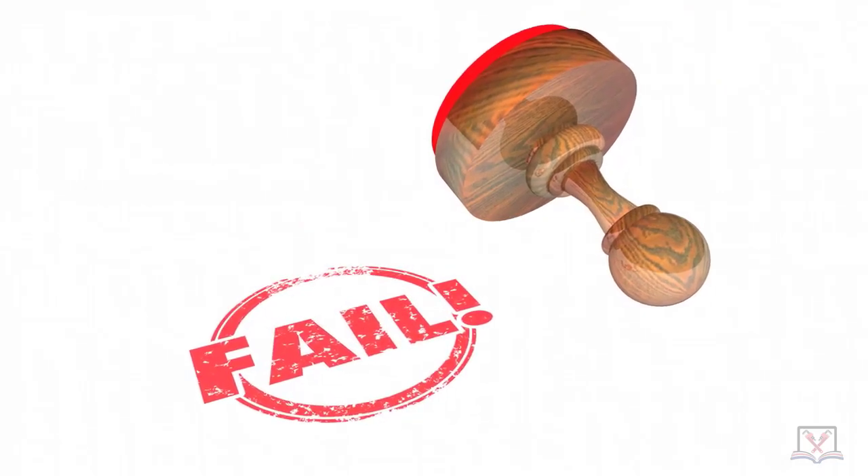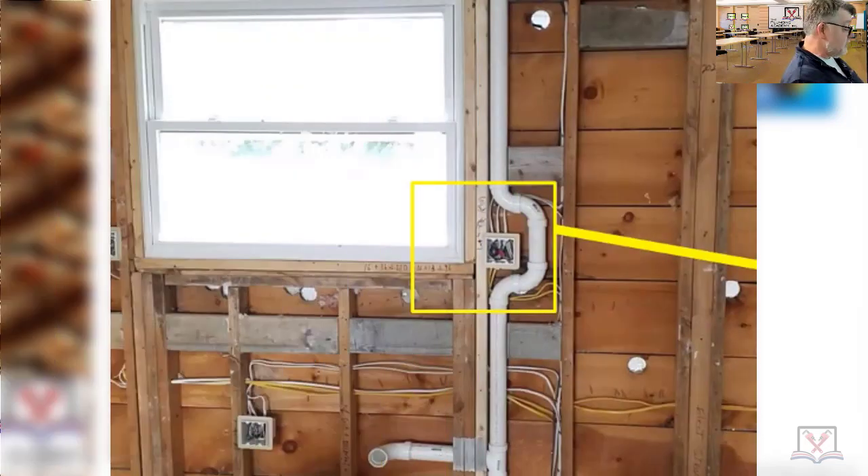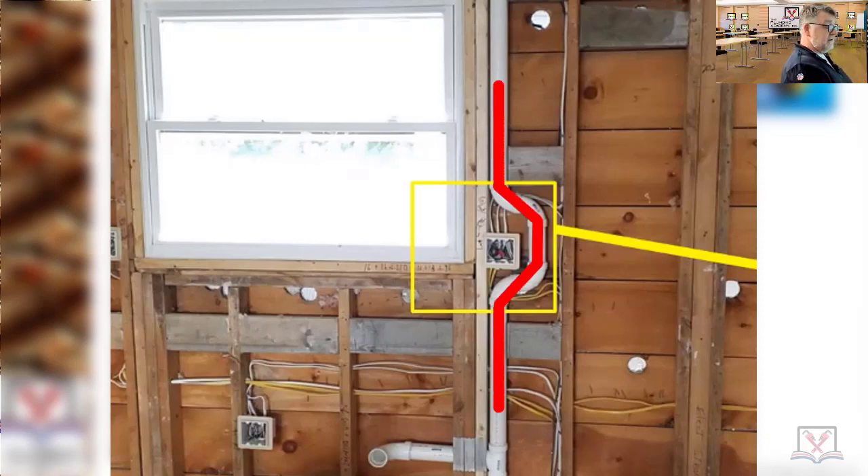Pass or fail? It's really, really close — fail. See you later, bye. Re-inspection fee, even though both the electrician and the plumber got spoken to. Here's the example: 42 inches is really the standard height you should always be thinking about when venting a fixture. You do not want to turn a vent horizontally until you hit 42 inches. The plumber could have put a couple of 45s — that would still be considered vertical if it was two 45s or a 45 and a street 45.